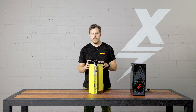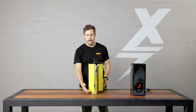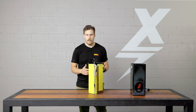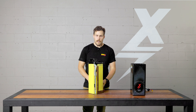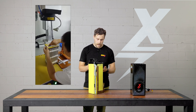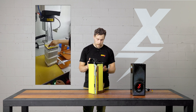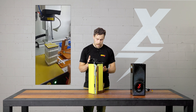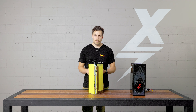Another thing we wanted to show is the process of laser welding — I know it's a little hard to see the bottom of that battery, but just have a look at this video. This is one of our guys in China doing the laser welding on the cells. He holds it in place with a little pair of tweezers and the laser welding machine goes ahead and stitches that together, which is an extremely robust way of holding these cells.